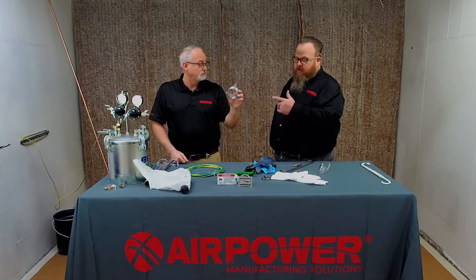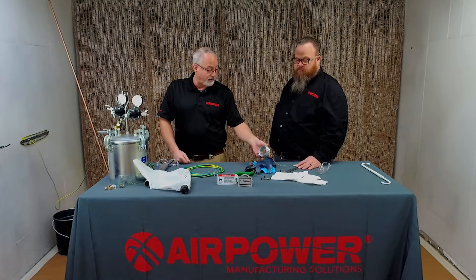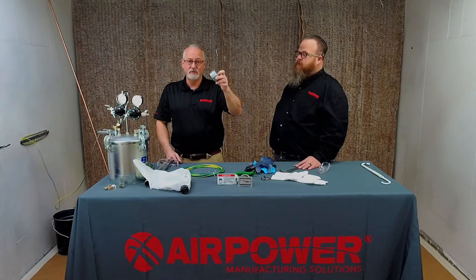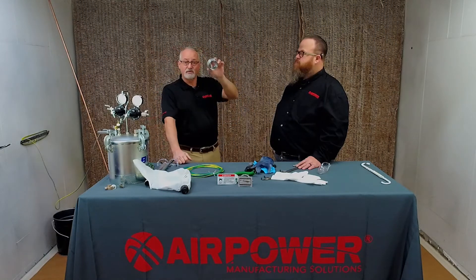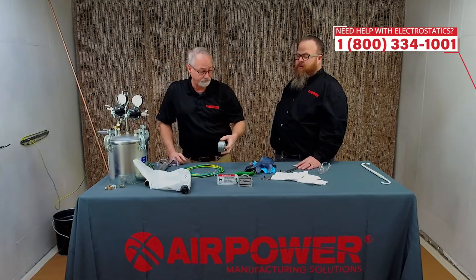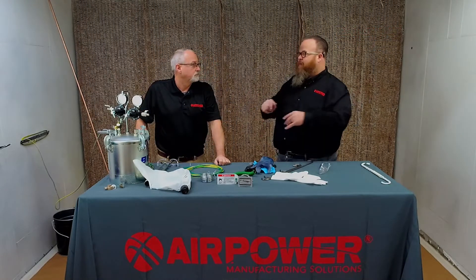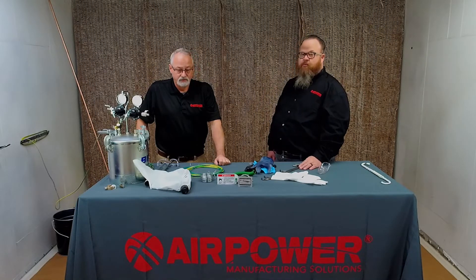Dainty parts may not be able to have a large hook. If you need to, just get some wire — baling wire, what everybody calls it — just some steel wire, some galvanized wire. Put that on up here, hang your parts from it. It works fine and it's disposable — it's not going to cost you much. You can throw it away, and when you get done with your run you just use wire cutters to cut the parts off one by one. It's a super quick process.